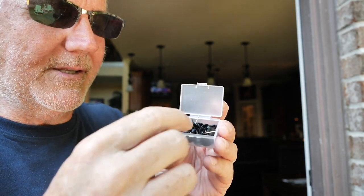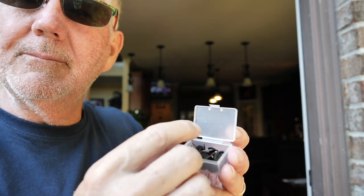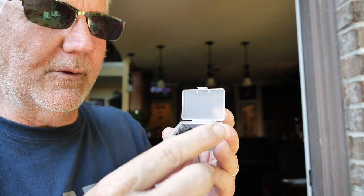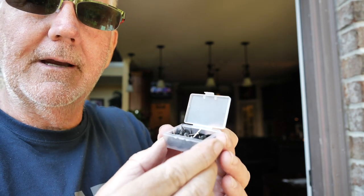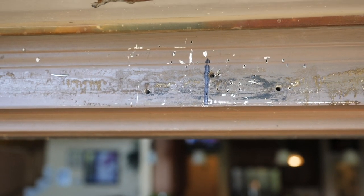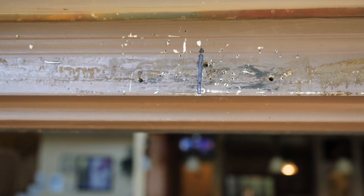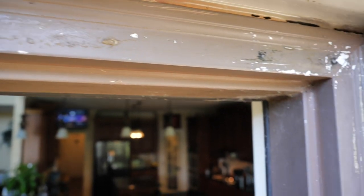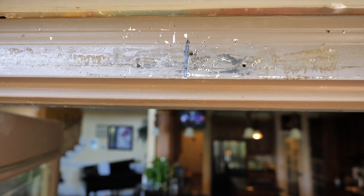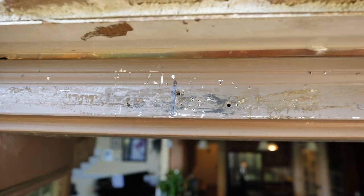On the instructions they give you these little push pins, and it's a little vague what to do with them. I'm going to use them to secure it temporarily to make sure I've got everything aligned. I'm on a stool at the highest part of the door frame — do you see that mark right there? That is 16 inches, which is the exact center of this door jamb. It's critical to know where the center is to align this up. I'm going to put the mesh up here and pin the center first before I do either side.